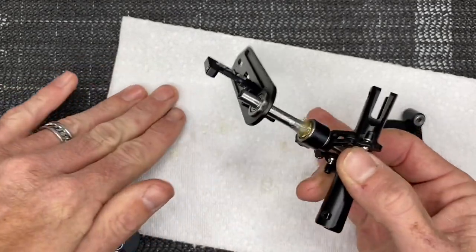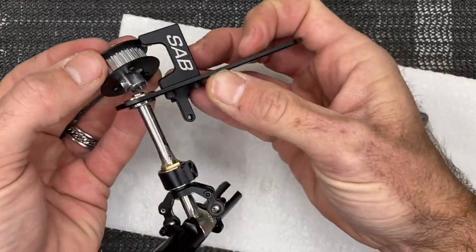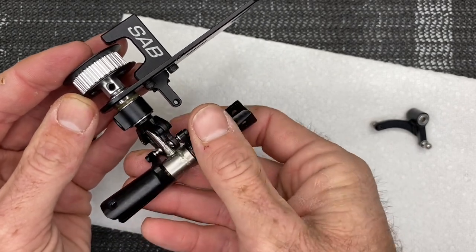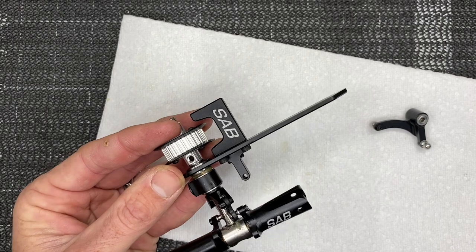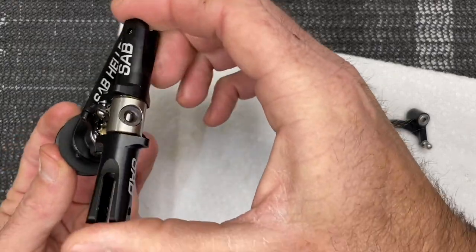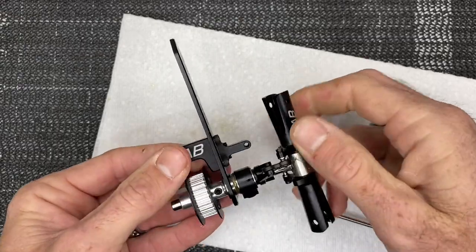Get it to the spot you need, grab your pulley — it has to fit into this groove. Push your tail shaft out a little bit, with the set screw side on the right, then slide your tail assembly back in. Line up the little indent in the shaft — you can see it as you rotate. Take your set screw with blue loctite, run it down until it snugs up in the groove. You can actually feel it's in there — that's how you know you're on the flat spot. Then torque it down.